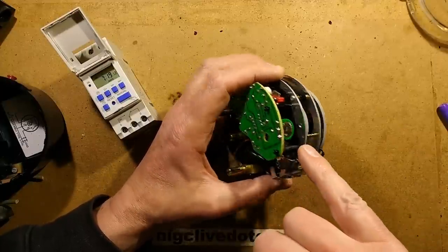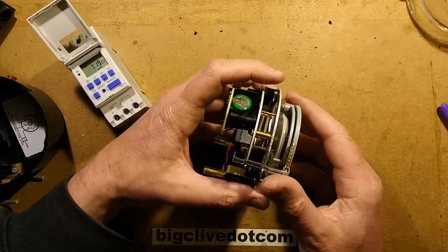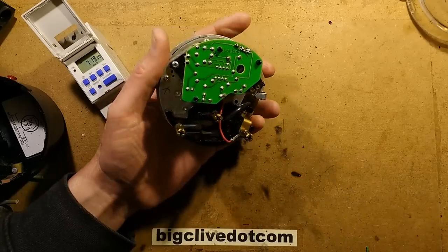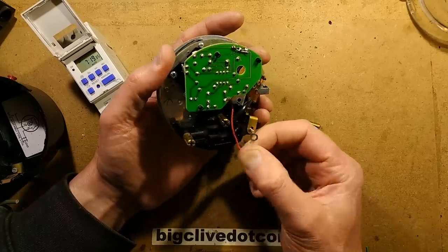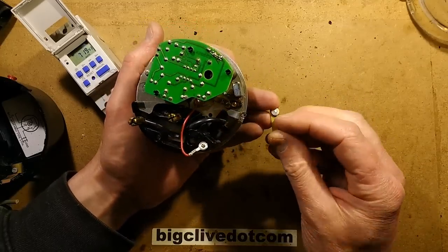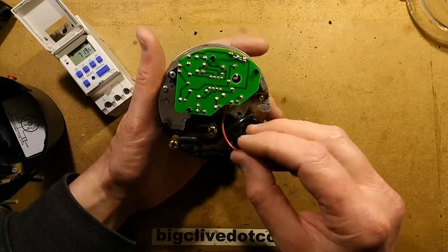Here's the new battery — because it only had two terminals whereas the other had two on that side, I put a bridging wire across and drilled a small hole. These pins just unscrew, and unscrewing the contact pin gives access to the contact so you can lift it out and expose the other for cleaning. You can see some modest pitting has occurred — it's been switching a modest load — but the contacts are absolutely massive, so there's still plenty of service life left.